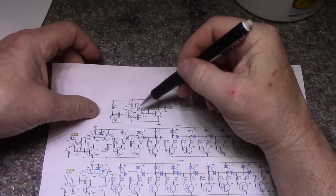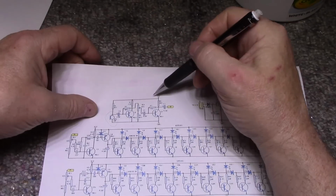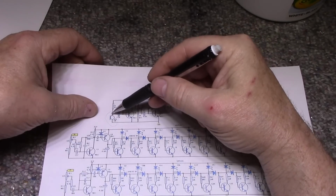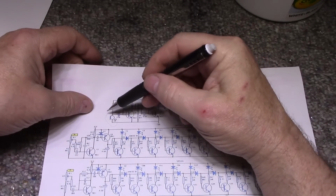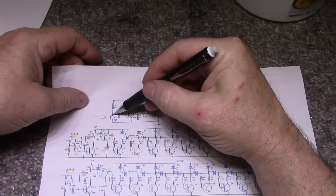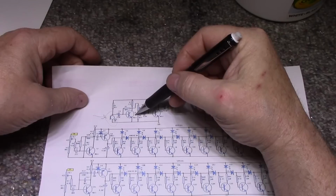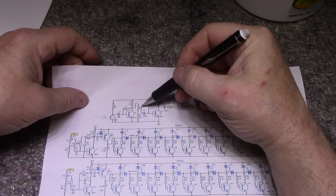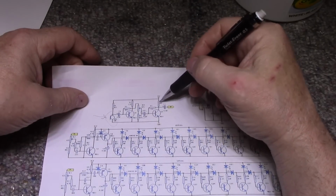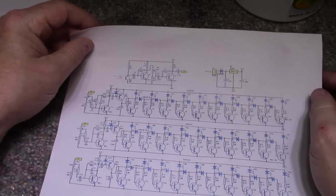Here is the input circuit, and then we have a condenser microphone here, and it's being fed with a biasing voltage through this resistor. Any audio signal that comes in here gets converted to electrical, flows through this capacitor, goes through one stage of amplification, and then there's a level potentiometer here, a blocking coupling cap, and then it goes into a second stage of amplification before it heads out to the 3 bands.